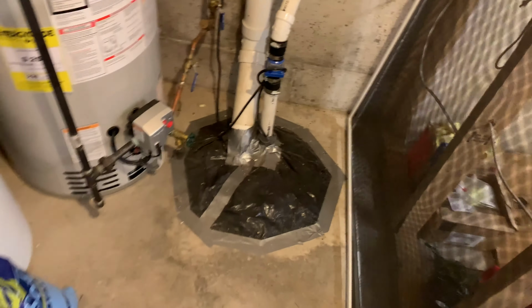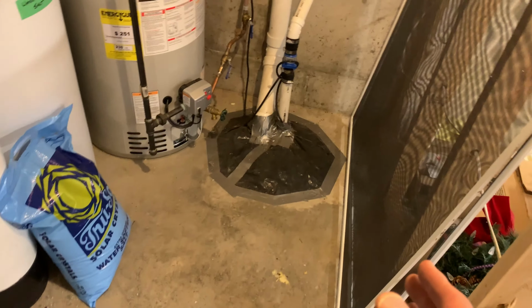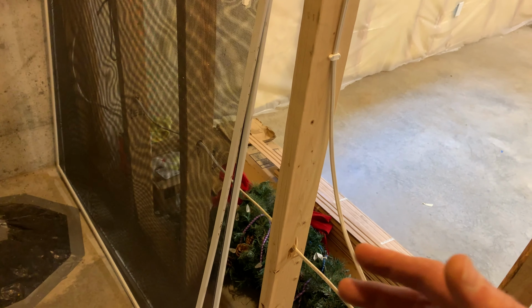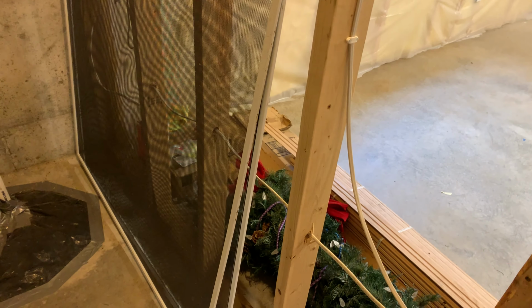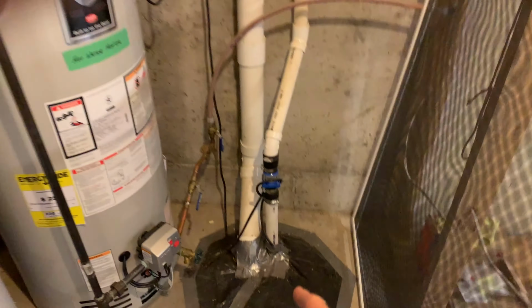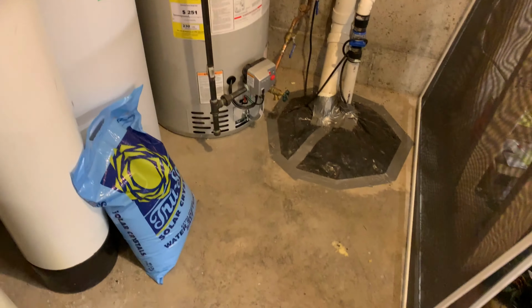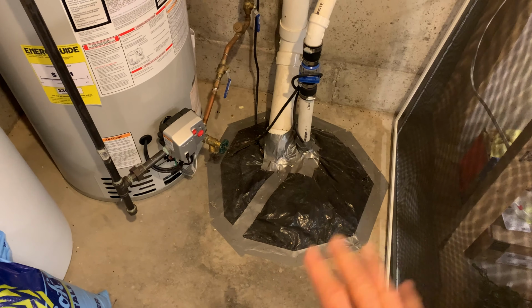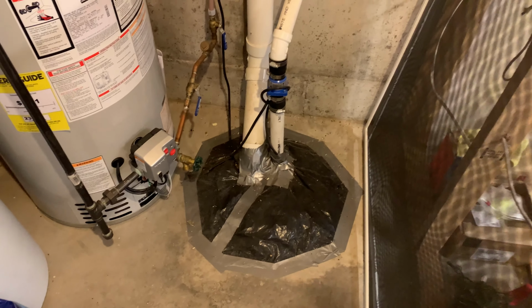There's two sumps. That one, there's actually vent tubes or trays built underneath the slab, and they feed into this sump, which then you've got this coming up out that vents that out. So that's why this is duct tape. You want to keep this closed, sealed, to prevent radon from getting into the basement.